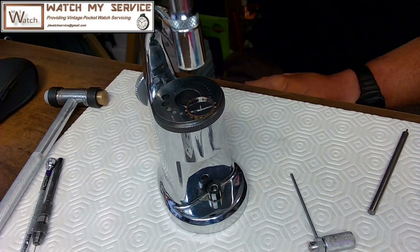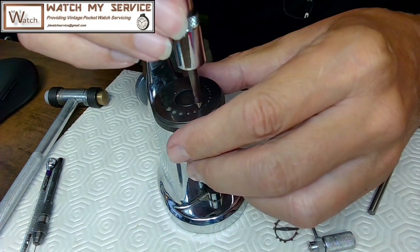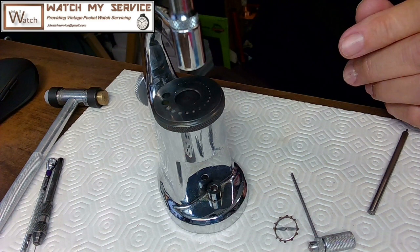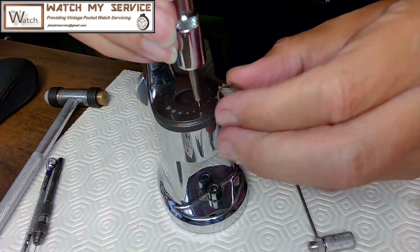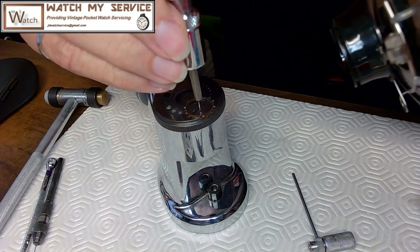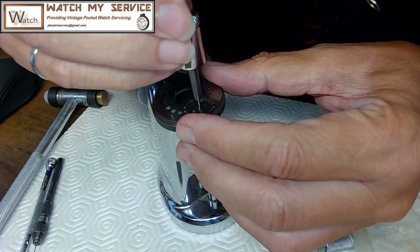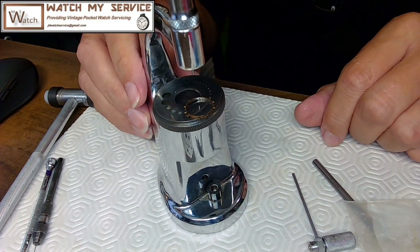Make sure I've got the right hole, go down on that hole, and press down making sure it's in there nicely. Then tighten the staking set and put the centering device away. Now I want to take the balance and look at my punch — I just want to see what this looks like inside. It might be a bit too big; I think I'll use the smaller one.